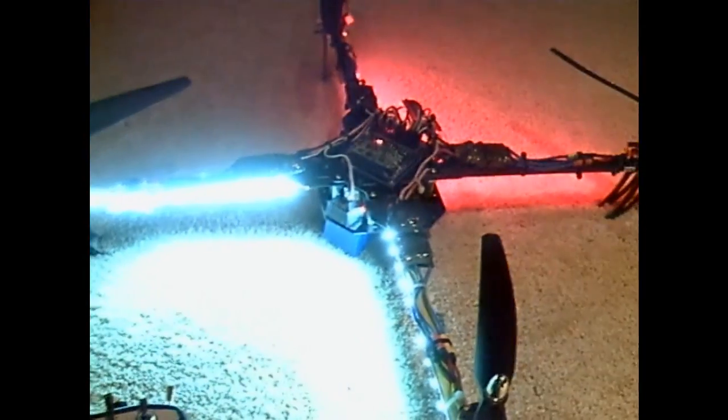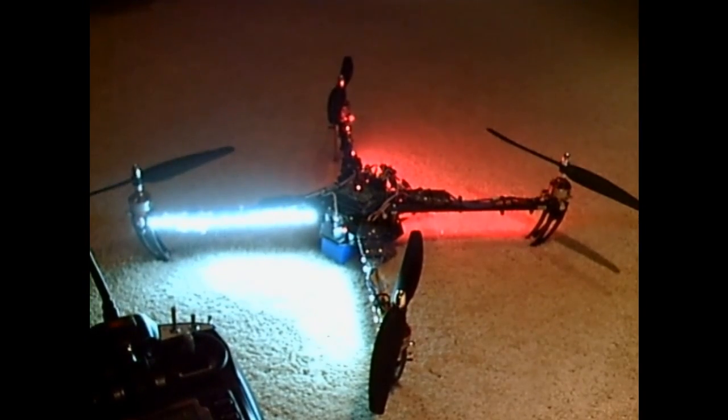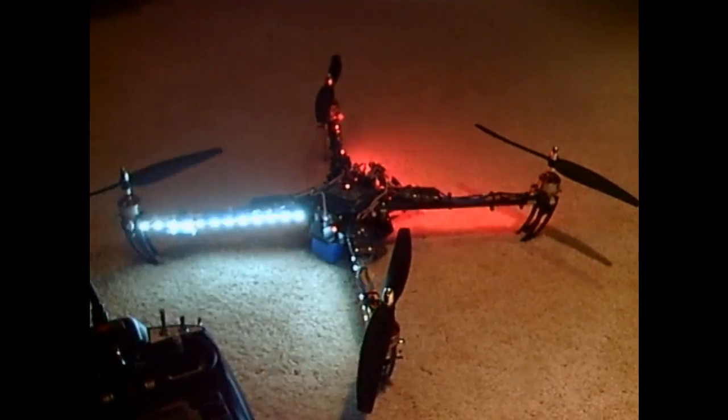You have a switch assigned to turning them on and off. When you put the switch on, they go to full brightness and are now very visible. You'll also notice a little blink or wink that occurs every couple of seconds — that's completely configurable in the MultiWii config file.